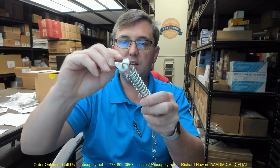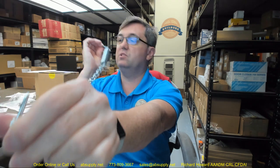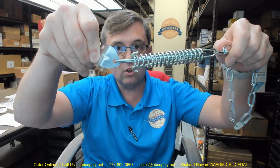What they want you to do with this bracket: the door is in the closed position — it will probably look more like this before you install the hold-up spring. When the door opens, it is going to open out like this. You don't want the bracket oriented like this; you want it on an angle. So when you position it on the header, move that spring so when it gets out here it is more in alignment. On a slight angle it is going to look like that on the header. Emulate what your installation is going to look like when the door is in its operating position, about 90 degrees. Make sure you can close the door without any conflict between the hardware and the door closing.